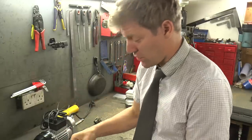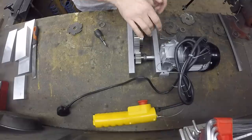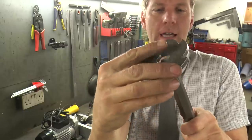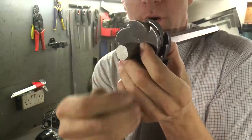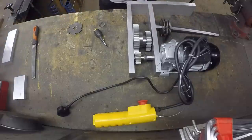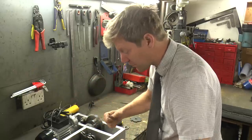I've wanted to make one of these for a long time but the making of it has held me back. Now I've got the old Swifty car I can do it. We've got some big gears to step it down so we've got more power - it'll run slower but I'd rather have power than speed. That feeds on to the shredding bar. For that we've got a bit of hex - our cutting blades slide over the hex so they can't slip. There are three different ones offset by 20 degrees so the teeth go in a spiral. All this is going to sit here, go all the way through, with aluminium housing around the outside - fix, pin, bolt it onto a base and we'll have two solid cutting bits feeding stuff through the letterbox.